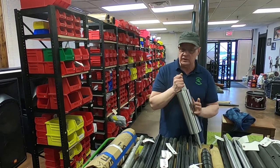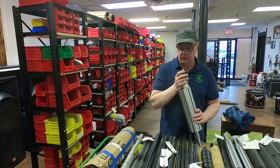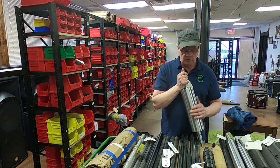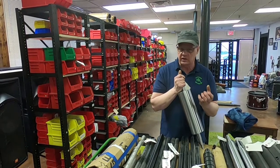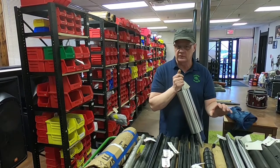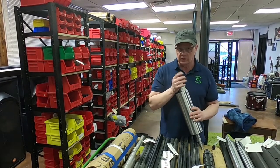It'll hold about 3 tenths. But you still need a grinder. We see a lot of parts come in — shafts that were sent in here to copy — and they weren't ground. So even though we can hold that tight of tolerance, when you take it out of a chuck and turn it around and put it back in that chuck, you don't know you're in the center. That's why we grind everything.